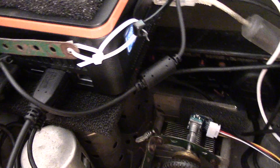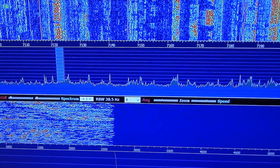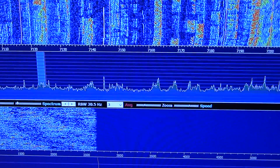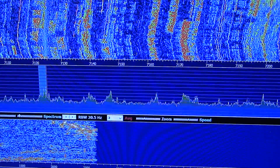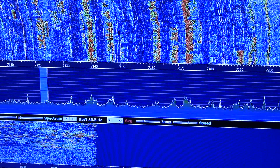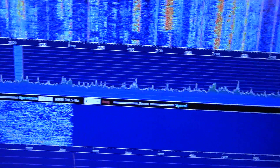We've basically had his help in being able to engineer this working demo. I've turned it on now and you can see we're on 40 meters, 7MHz, and I'm now just turning the main tuning. Unlike a normal SDR where you'd typically point with a mouse, we're only allowing ourselves the controls of the CR100. The software is configured such that as you turn the tuning dial, the point that you're receiving moves through the center of the screen. On the spectrum display you can see all the other strong signals romping in here on 40 meters in the afternoon here in the UK.